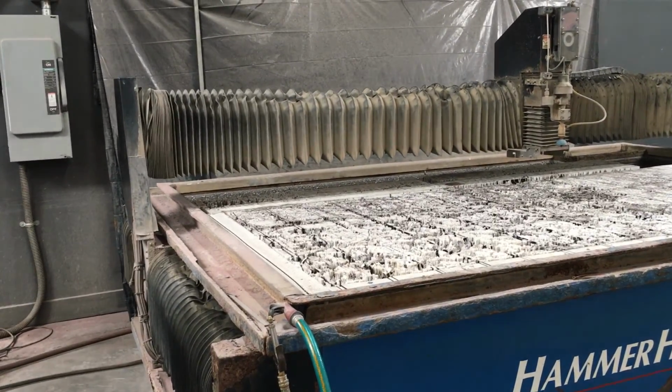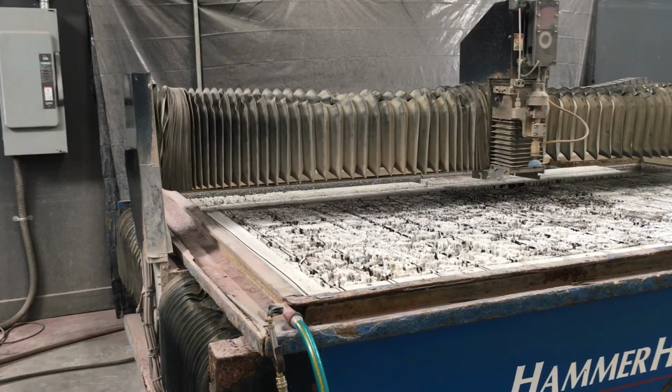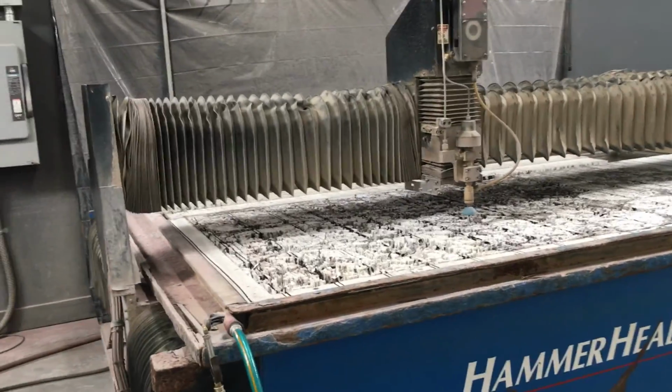And I'll tell her, just go to home. And it will literally be within 1.5 thou of where it was on X, Y, and Z. Wow. And then you've already loaded your part in there, ready to go. Yep. So right now I'm sitting.